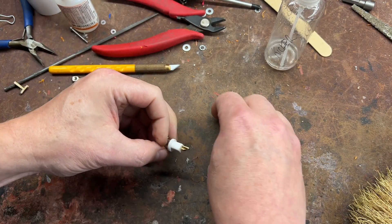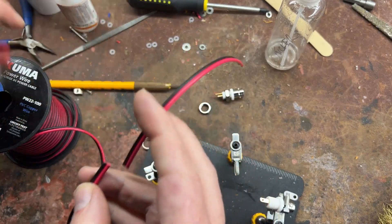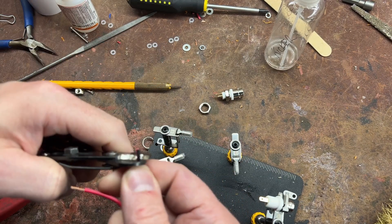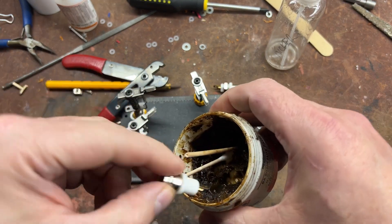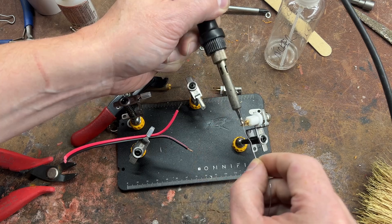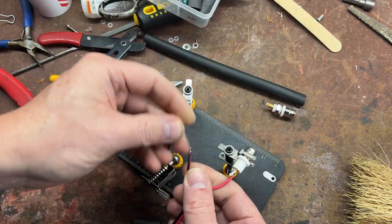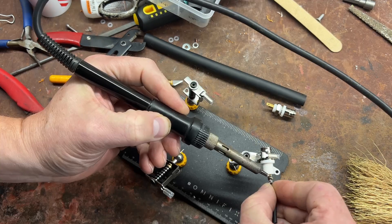What you're going to do is take the nut and washer off of this BNC connector and tin the two ends so that you can solder to it. Grab some wire and tin it as well, and join those together. Really important step here: you don't want these things to short out onto each other, so on one of the wires run some heat shrink over it so it doesn't short out on the other wire.